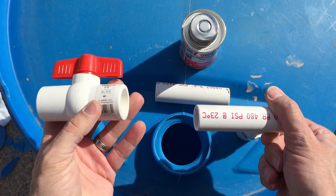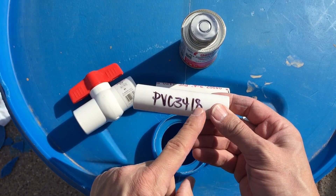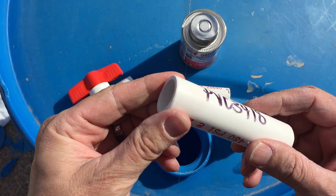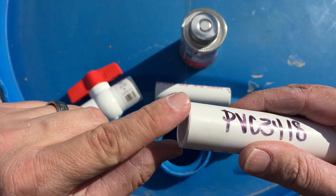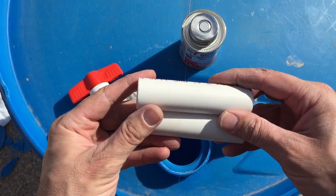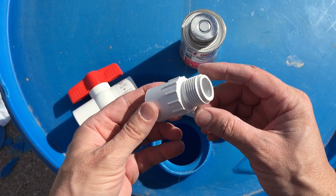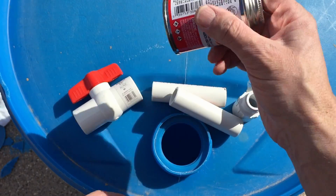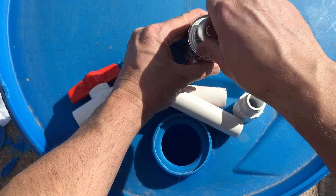Now that we've got our seal, the next thing is to glue our PVC pieces together. I went ahead and cut these pieces about four inches — you can cut them however long you want depending on how far you want your spout to extend out of the bottom of the barrel. I did sand around the edges to chamfer them a little bit, making them easier to slide into each other when putting the pieces together. I've got two pieces approximately four inches each, plus the hose bib, and now let's go ahead and glue them up with the PVC glue.